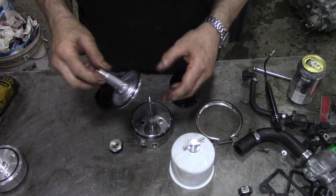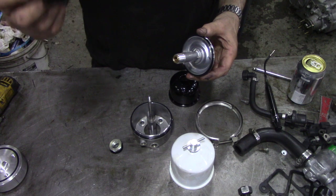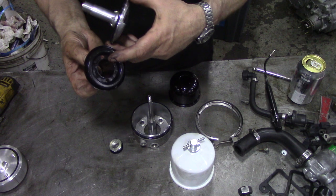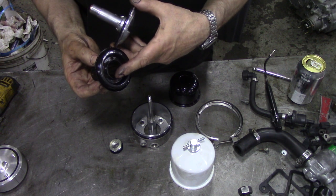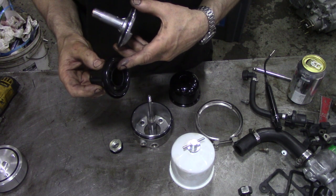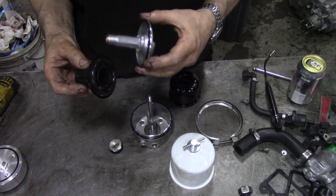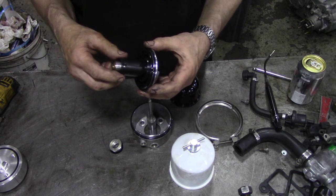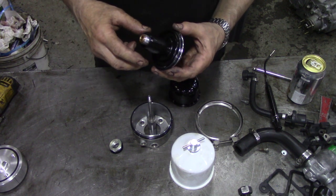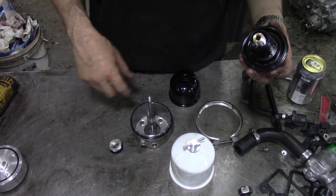Now this spinny thing has an o-ring in it, but there is a defect with this bit — we found out yesterday when we were trying to run this with compressed air. If you ever get one of these, just check this piece here. JP worked out it was about 30 thousandths of an inch oversize, so he took off 20 thousandths just so it would clinch tight. As it spins round, it's supposed to stop dirt getting into the filter bit down the bottom.